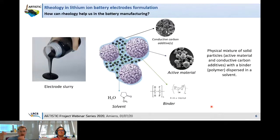Let's go back to the electrode manufacturing procedure. The first step is the fabrication of the slurry. We mix our active material — for example, NMC particles — with a conductive carbon additive, and we use a polymeric binder dissolved in a solvent to give stability to this suspension. This mixture is generally a physical mixture, though some use chemical bonds to increase stability. The stability and interactions between all these particles can be quantified through viscosity, which is the resistance to flow of all these materials suspended in the liquid.